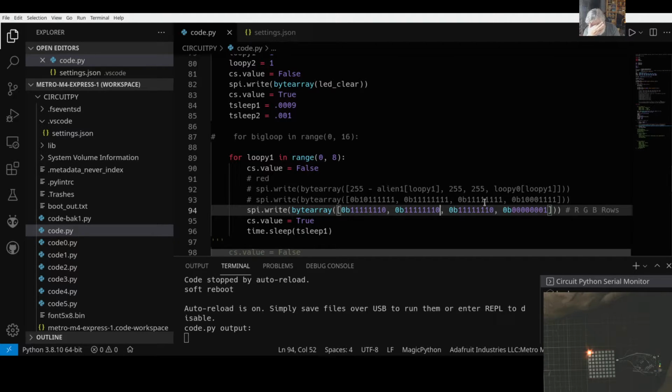Now I had it so that I figured out kind of how to position the colors, similar to how the row one works. So I got 3 blues on basically, but this is what's driving me batty, the persistence of color problem, where you have to drive all the rows, constantly sending all of them correctly. So to me, this panel is almost a dead end. It's more work than it's actually worth working on.